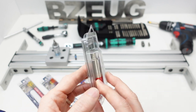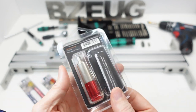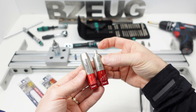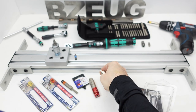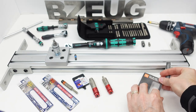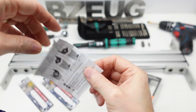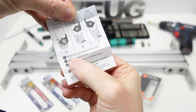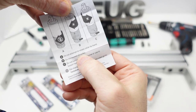The inch-pound version is the Fix-It Sticks all-in-one torque driver, which says it is made in Taiwan. It's a little bit different but very similar — you can see the similarities and differences. The nice thing Fix-It Sticks did was include a small instruction pamphlet that answered one of my questions. It says: do not attempt to rotate collar by hand, and do not exceed 65 inch-pounds, which is a little over 7 Newton meters.